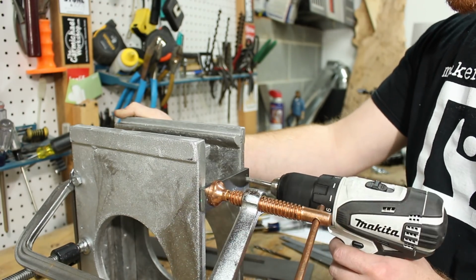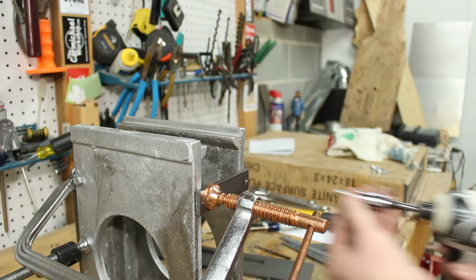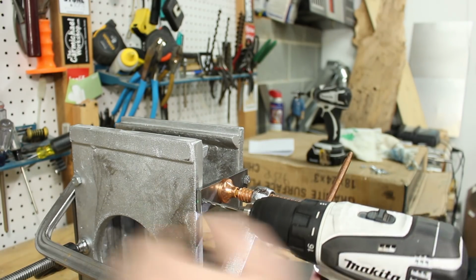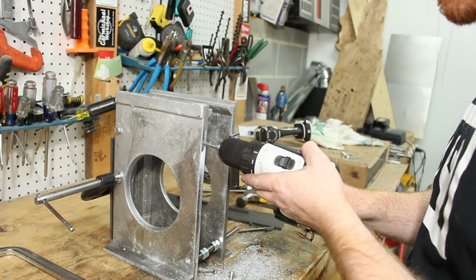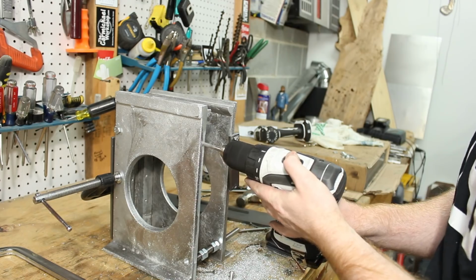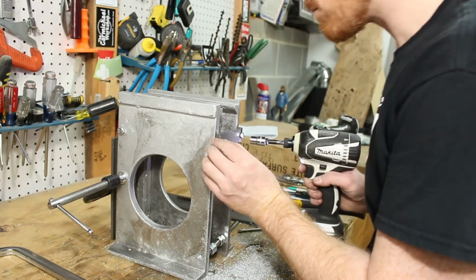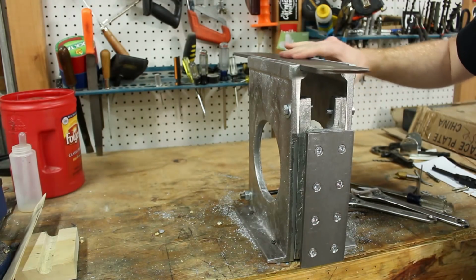I used the hole in the spreader to help align the tap. I used an M6 fastener here. After I had the first side fastener installed, then I switched over to the left side and used the hole that I had drilled on the drill press to help me get everything lined up. Next up will be the ram and fitting the ram slideways into the column.